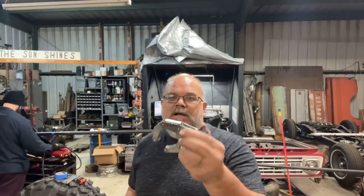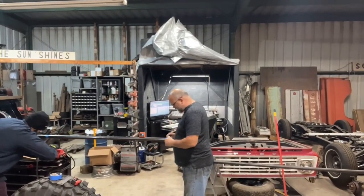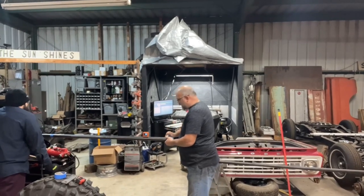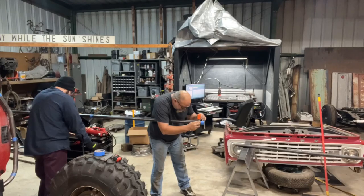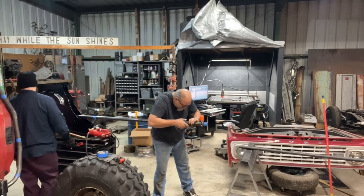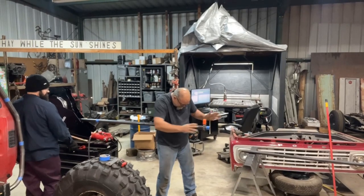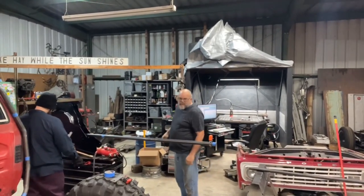Zach made a little cam twist clamp with a small flat plate on it — stick it on there, works pretty good. They're already clamped in. Whatever we set this to, we call zero. So it's 0.1 right now. It's pretty hard to get it perfectly straight up and down, but it's real close. So there's our zero.